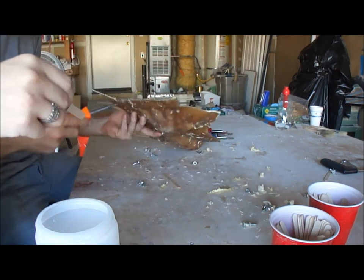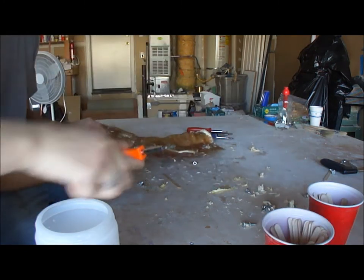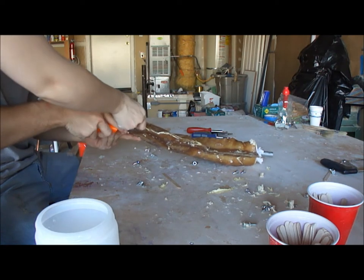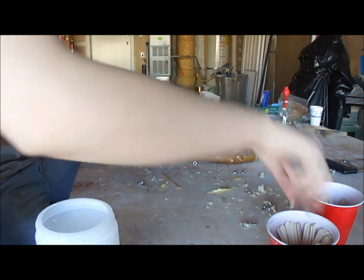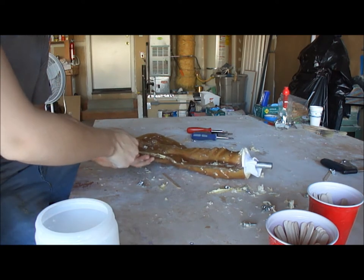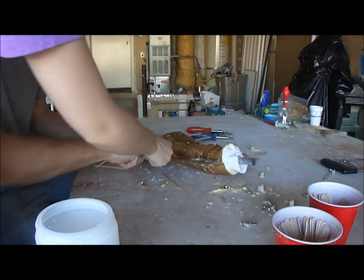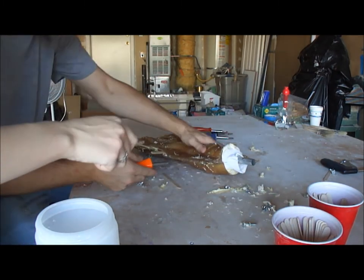This is going pretty well. You might see steam escaping — that's normal. The mold is actually still about 100 degrees or so right now. This just makes it easiest to get the material to release from the mold; it has a tendency to stick if it cools. This is easier the third time — I think it's called a seasoned mold at this point.